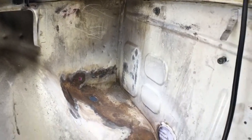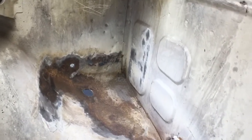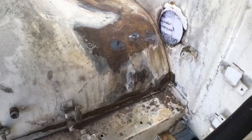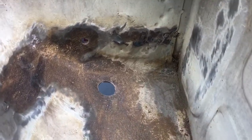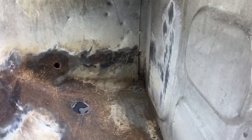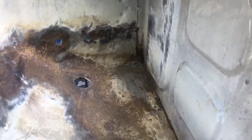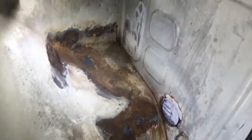The first order of business: you'll see that something is missing. Yes, we pulled the battery tray out — we are going to relocate the battery to the back of the car — but it left us some nasty rust, so we need to take care of that. We're going to sand this back to metal. There's a hole you could put a pick right through, and there's another hole over there because I was learning how to use a spot weld cutter for the first time, so I went right through. Lesson learned.